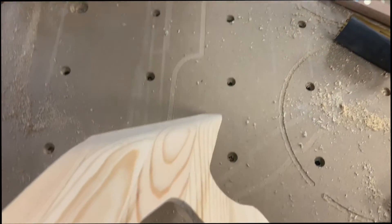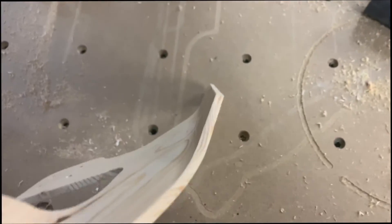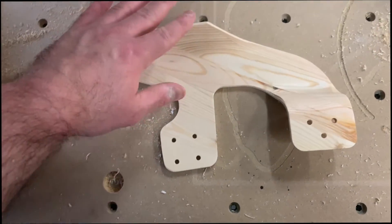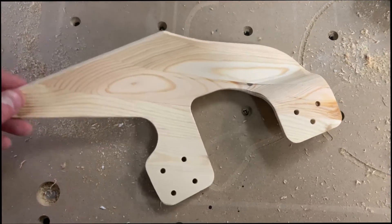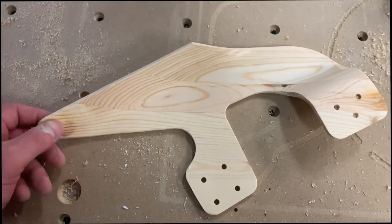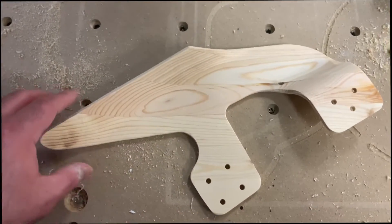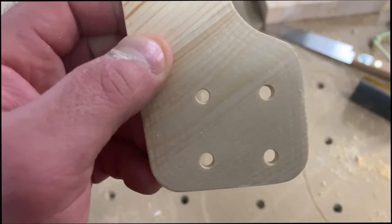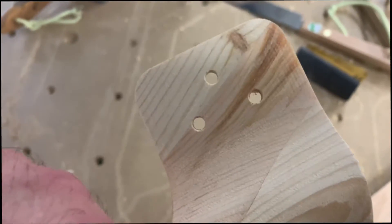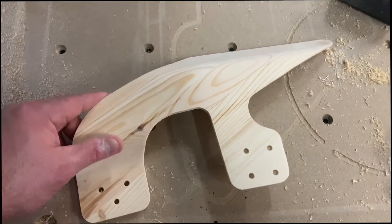I got this part dressed up — I'm going to show you what it looks like. It's got compound curvature in this direction, and this little flange here pops out. This really wants to be a sheet metal part, but if you wound up in a situation where you needed to machine it, this is what it would look like. Because it had the compound curvature to it, the machine shop just thought it needed to be a 5-axis part. A lot of it is about nesting — make sure you have a draft angle and that you don't have any tool entrapment issues. Also, if you have a flat face like these two, you could use that as your parallel surface to index off of. I went ahead and opened these holes up with a drill press — they look pretty good for wood. What's really interesting is how good the surface finish feels; those ball end mills really do a good job of keeping everything smooth. If I put finish on here it would be very shiny.